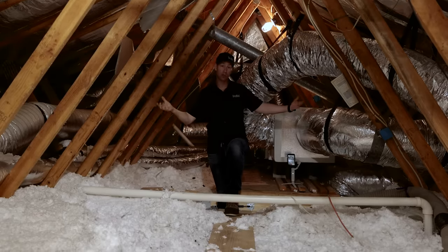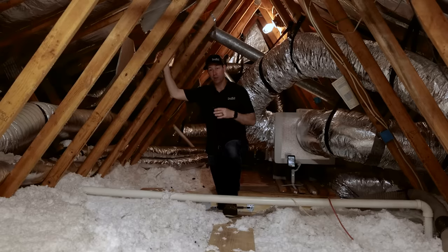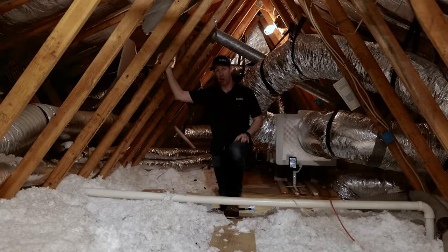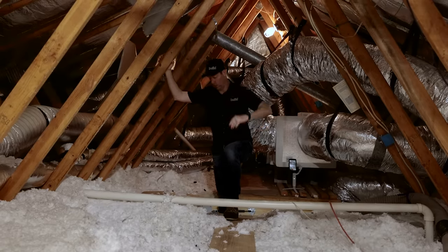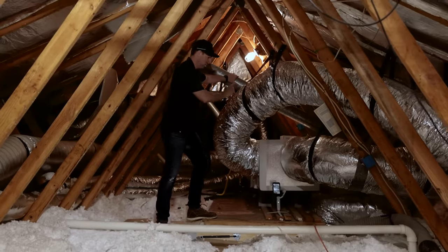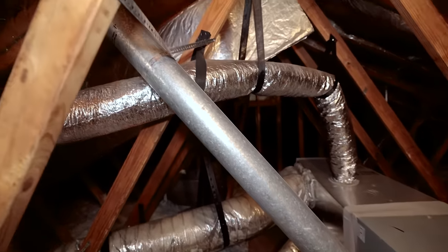There's even new construction in Texas that looks just like this attic, with ductwork and insulation up here. Remember, we have no basements in Texas, so typically you'll see ductwork and a furnace and air conditioner up in this attic space. This is also common throughout the South, and even some northern houses. We first thought about spray foam at the roof line, but the reason we didn't do it was this vent right here.